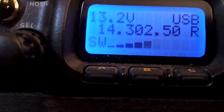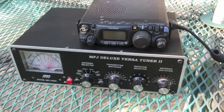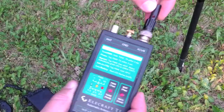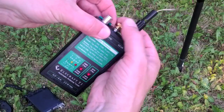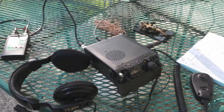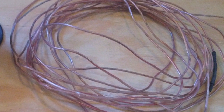It's probably going to be close enough as it is. Of course, if you use the coax method, you can always add an external antenna tuner between the radio and the feed line. My favorite way to connect the radio is by using this little auto tuner from Elecraft. I use an adapter to plug the antenna into the antenna jack and then connect the other wire to the ground terminal on the tuner. Finally, connect the radio to the tuner with a piece of coax. This allows me to quickly tune and use the antenna on several bands. Adding ground wires cut to a quarter wavelength on each band will make it work even better.